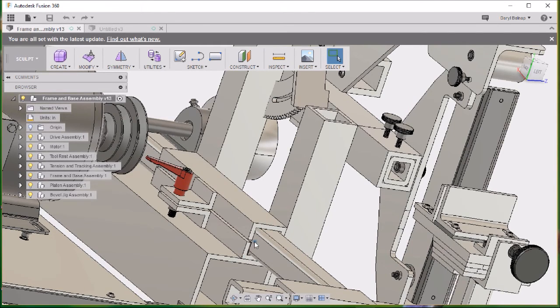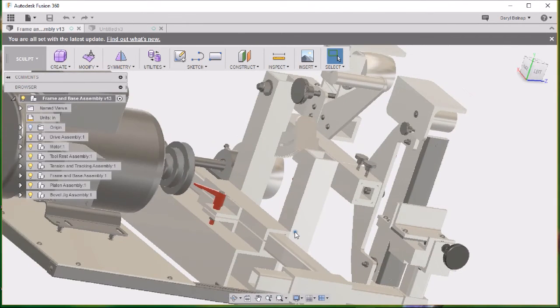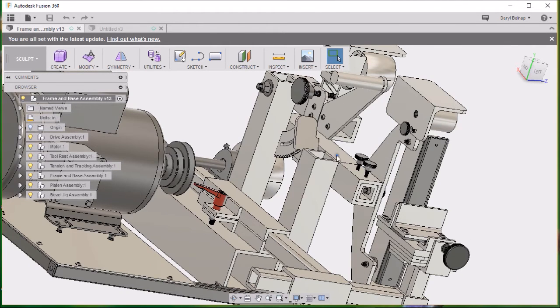Inside of the steel pipe there's also a seam where it's been folded over and then welded down a seam. So you have a seam in there to deal with in addition to the sloppiness. That sloppiness was in here, and in this mechanism on my current sander, and it would slow me down when I wanted to make changes, because I would have to be very careful to get all the slop out in the same direction every time to get consistent results on my bevels.